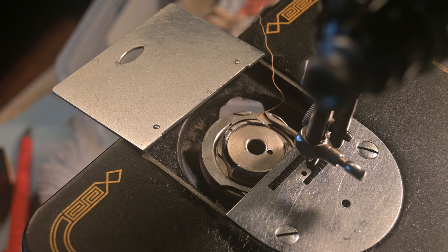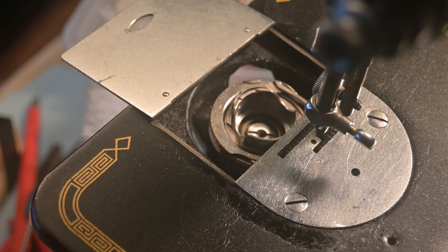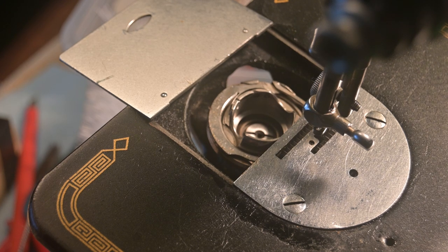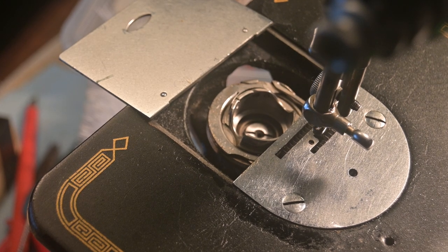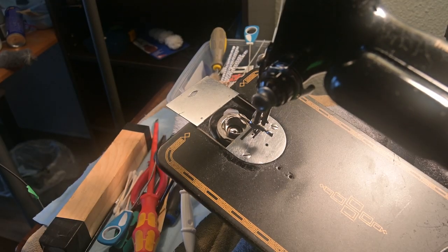I want to continue oiling and greasing the underside — the bottom of the sewing machine. First thing is to take out the bobbin. I'm going to start here first, get some grease on there, then glance over and get some grease on that side as well. I'll rotate the hand wheel to make sure I get the back of the gears too — it's easy to forget. I'm giving everything a good rub with the cleaning tool, trying to get the grease in between the gears and the underside of each gear. You're at Jeb Adams' channel — subscribers are welcome. If you hit the notification bell it would be of assistance to the channel.